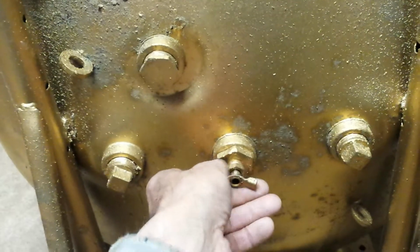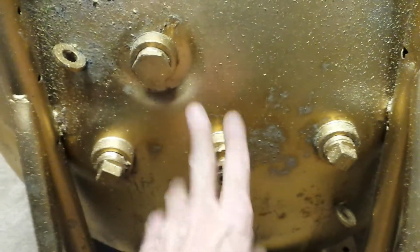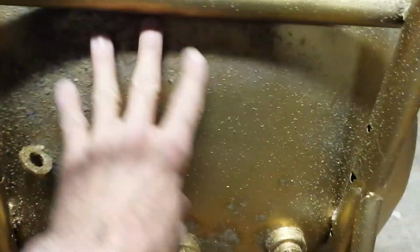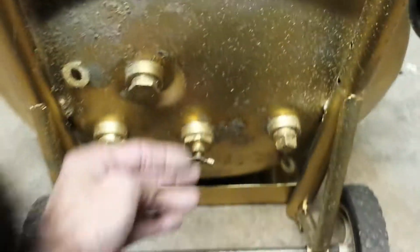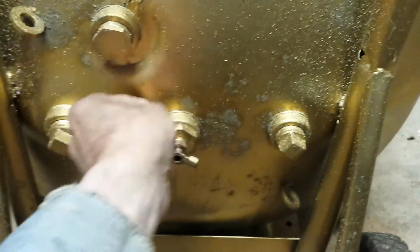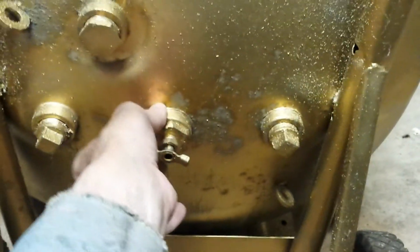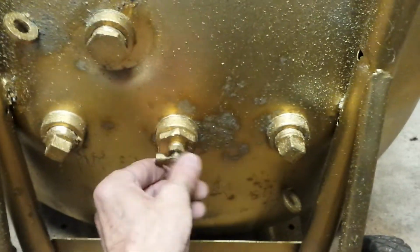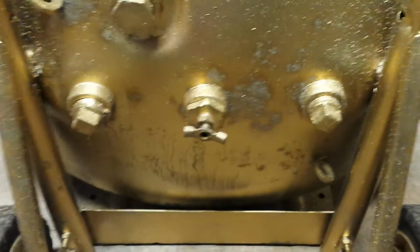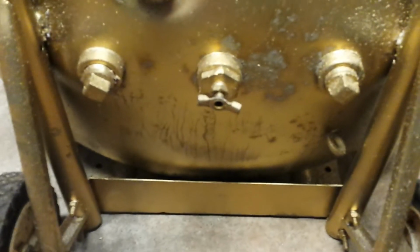And then the water heater itself will have a pressure relief valve. And I just went ahead and put the bleeder valve here, because if you notice, this kind of angles down. So all the water droplets and everything will run toward the center. And I tried to make sure that this didn't stick up, so this will literally funnel right into here, and then you turn that on, and it'll drain the water. I'm being attacked by a cat, so I'm a little distracted. The video is going to move a little bit.